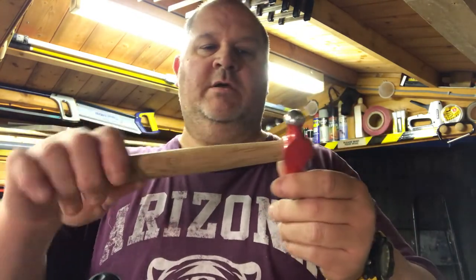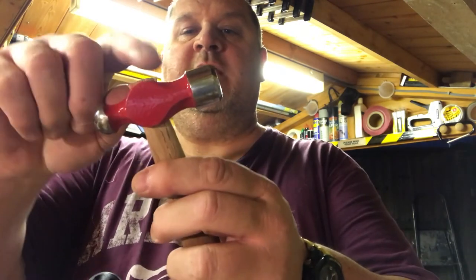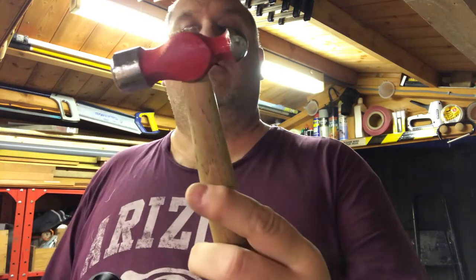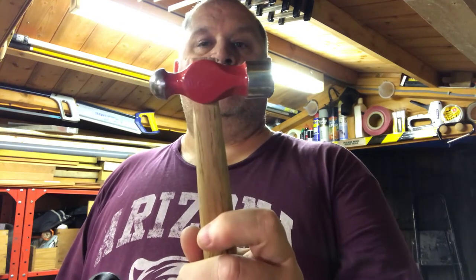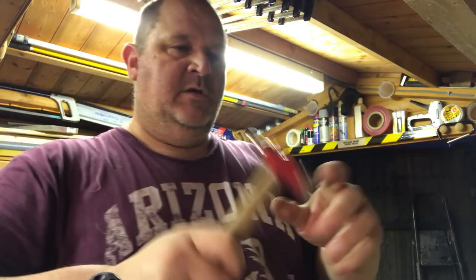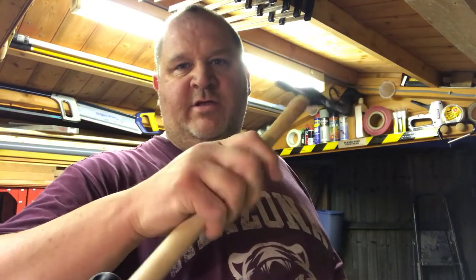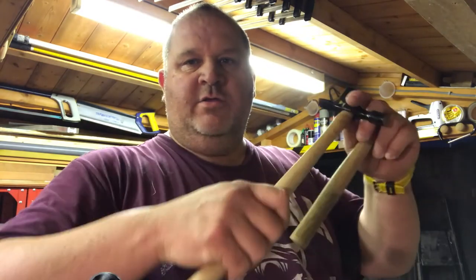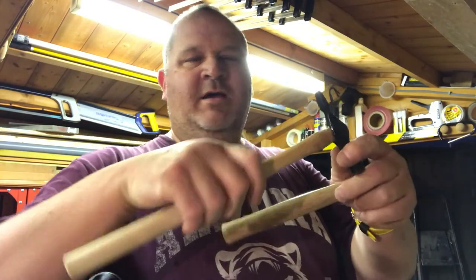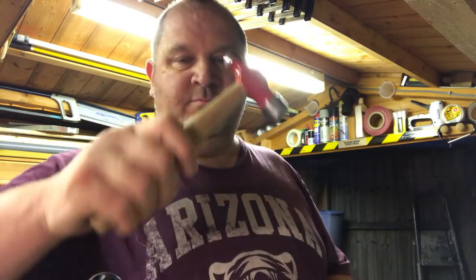The length from one end to the other is 8 and a half inches, and the handle itself is just over 7 and a quarter inches. I'm going to coat this in Ballistol to sort it out and smarten up the end a bit. It's a nice small one but the handle is not too small, so it's going to give me a little bit more control. With pin hammers, if the handle is right down there, unless you choke down on it — which changes the way you hold it because the handle hits your wrist — it gives a different sensation.